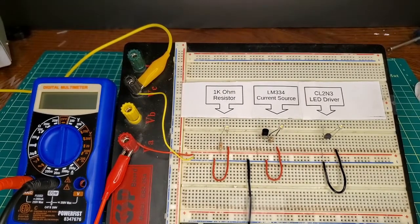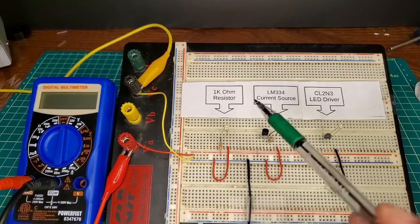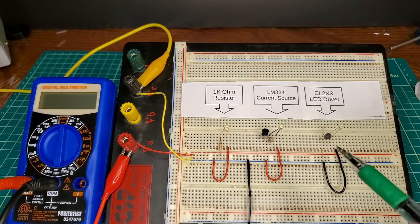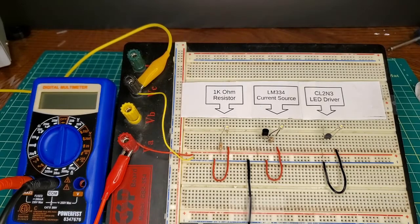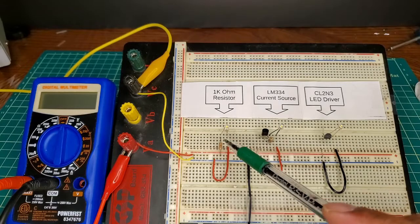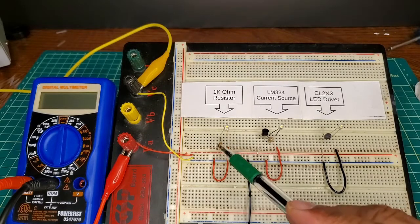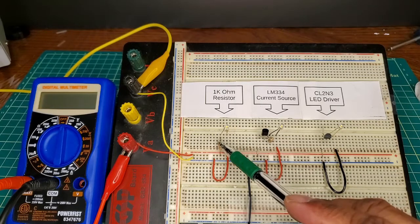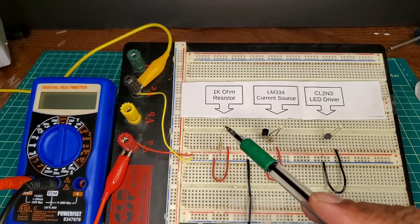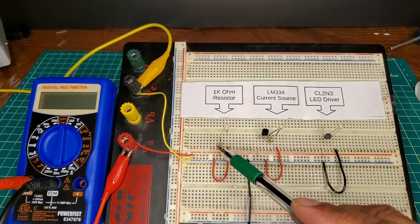Let's move on to the methods for using LEDs on your locomotives and passenger cars. I've got three different methods outlined here, and I've actually progressed through all three. The first method is using a resistor in series with your LED, which acts as a current limiting device. Based on the resistor value you choose, you can decide exactly how much current passes through the LED. Since LEDs are current loads, you must ensure the appropriate amount of current flows through them.